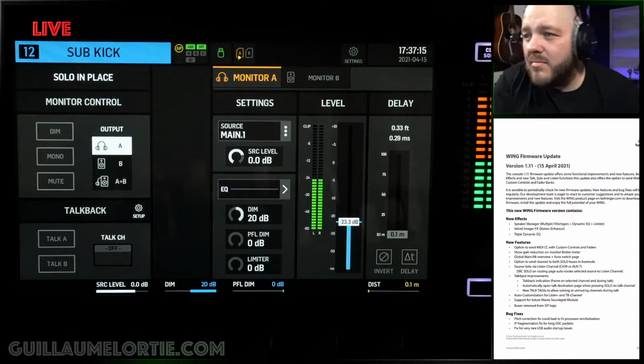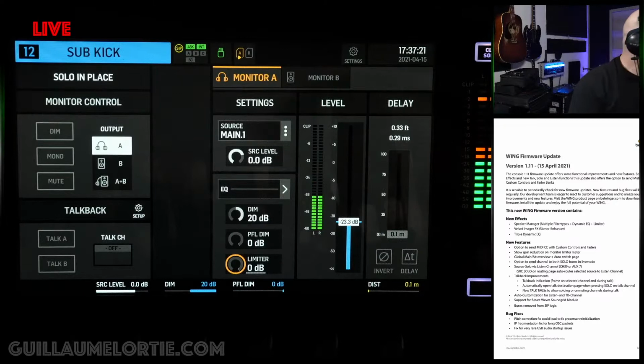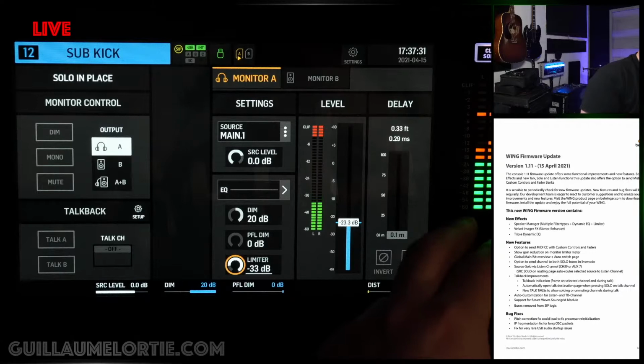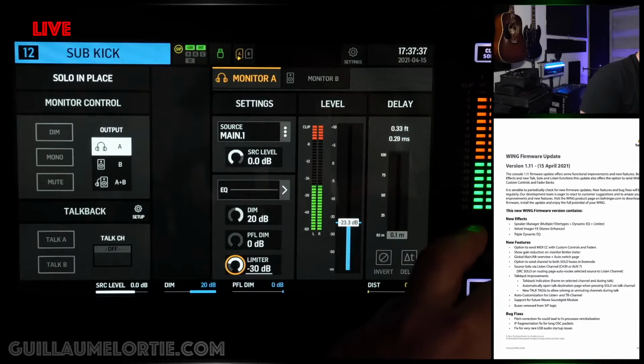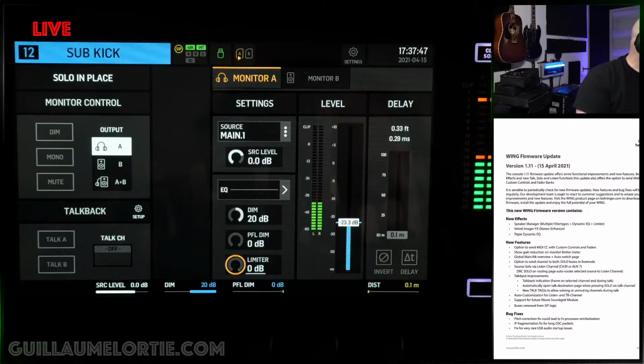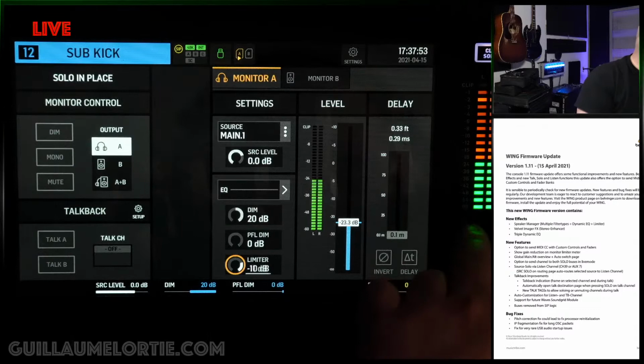Okay, so the limiter is in the middle here, like Rob just pointed out. Thank you very much, Rob. You guys probably don't hear it because it's in my headphones, but it's hitting really hard. I'm gonna guess it's the same kind of limiter that we have on the crossover. So it will be a really hard limiting with no attack and not that slow of a release. And it's just gonna limit your input.